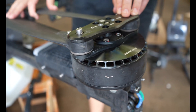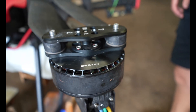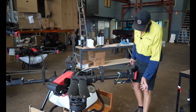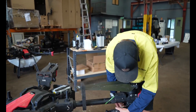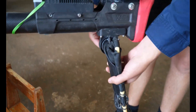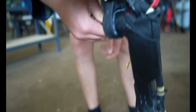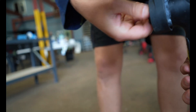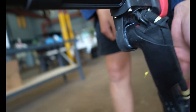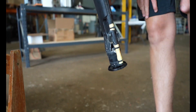The bearings are very easy to replace and you can get the parts from any bearing shop. As long as you give it a good wash you shouldn't have those issues. In terms of the nozzles, a big thing is these clips — they can eventually wear out. We recommend when folding the arms back for seating or transport, loosen off that screw at the back, otherwise you can snap those little tabs off that hold it in place.